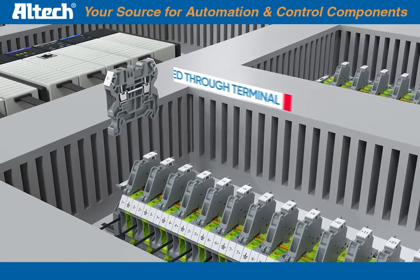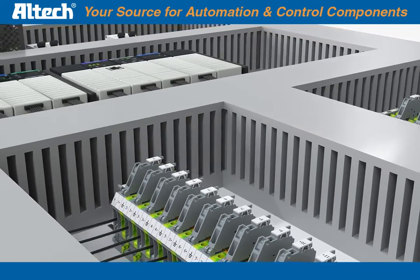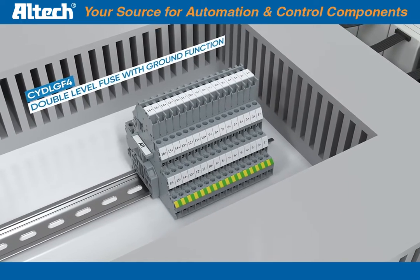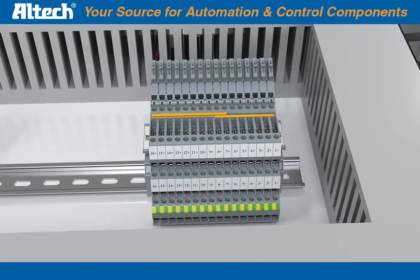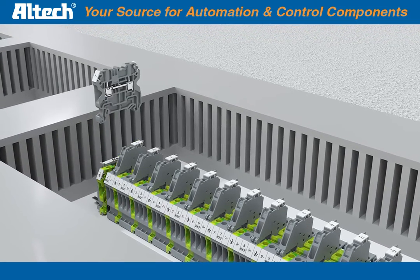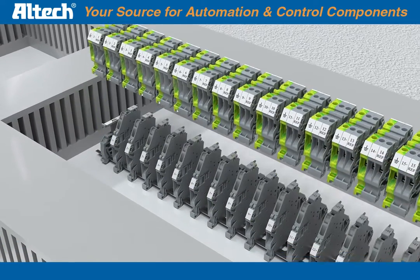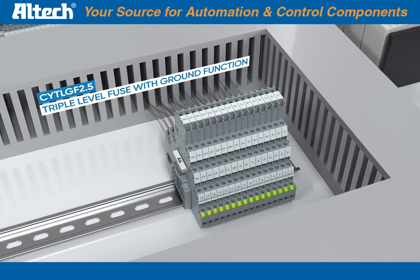To connect 3-wire devices with ground protection, a triple-level terminal block with a unique functional capability on each of the levels replaces 3 terminals and saves 66% of space on the DIN rail. Each of the levels can be bussed by using standard pluggable jumpers. To connect the more complex 4-wire sensors and actuators with HART protocols, a 4-level fuse terminal with integrated ground function is an ideal solution, saving 75% space on DIN rail. These terminals also help in simplifying circuit identification.